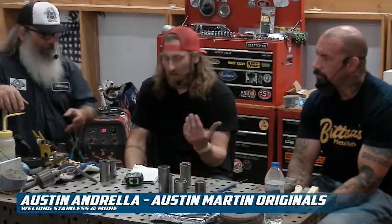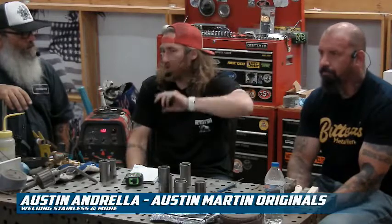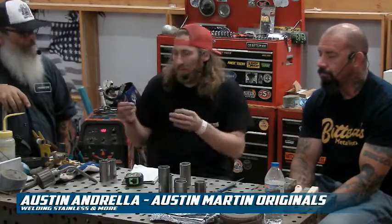That's rod. And a lot of times amperage is associated with heat in a part. People think if you turn it down, it could possibly cool off your weld, as far as how much heat is going into the part. But it's not necessarily the amperage, it's how long you're lingering. If you set it too high and you're getting the metal too hot by not moving fast enough, it's a rate of speed. Every time you dip, it's going to cool the weld slightly. That's what I was getting at, people think they can just turn their machine down, but in reality, it's how fast they're moving.